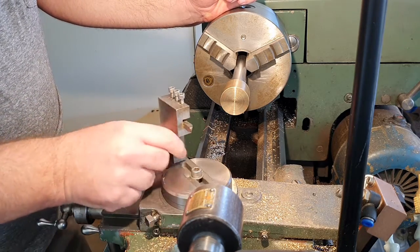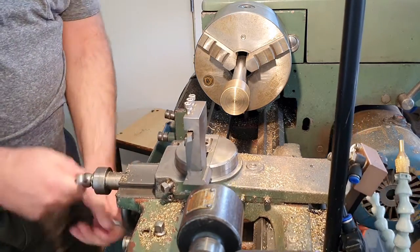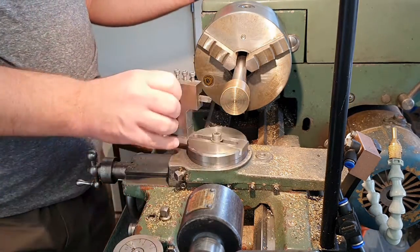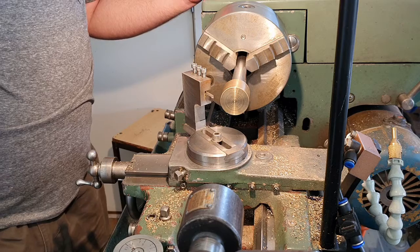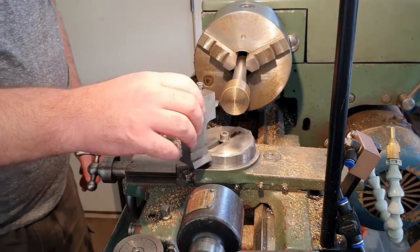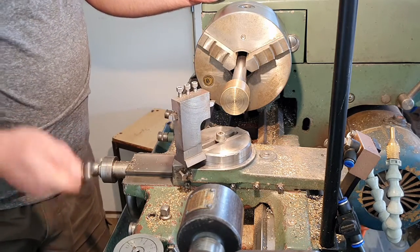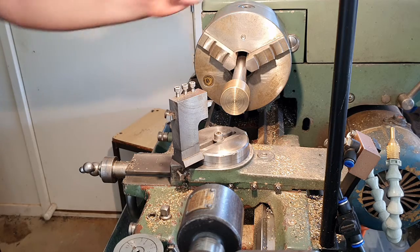At the moment this is set for a pretty small shape, to be honest, so I'm going to have a bit of a crack at setting the tool up, so that we're turning a reasonable radius. I'm going to do that off camera. It's going to take some fiddling about, and you test basically visually by going from the end of the sphere, which is the end of the part that we want, around until you're clearing the back of our blank. And that's the process. It'll take a bit of adjustment and trial and error until I'm happy with how it goes. But before we start cutting, I shall come back and we'll start turning this thing into a ball.